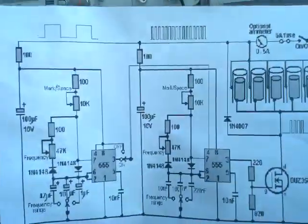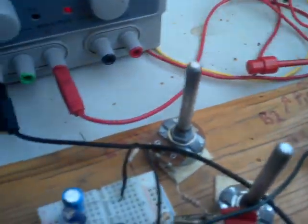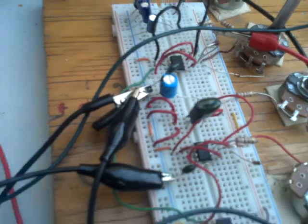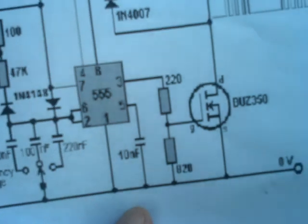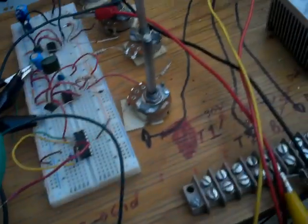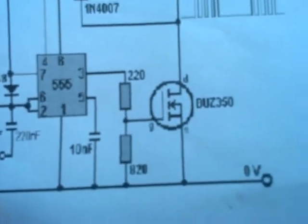If you want to see the Dave Lawton circuit that I used, it is right here. Right now I am tapped into the smallest capacitor here, which is one microfarad, and I'm using the smallest one on this side, which is 10 nanofarads. These are electrolytic capacitors on this side, and these are the ceramic ones on the other side. So I'm doing it exactly like they say.